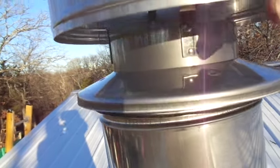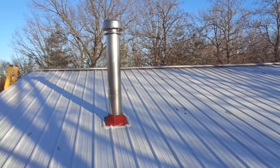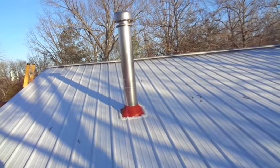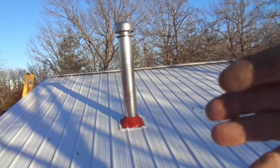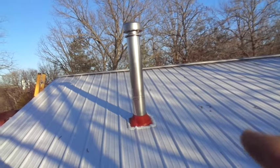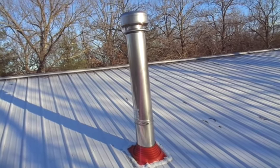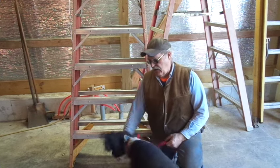These are the variations that vary from state to state, county to county, province to province if you're in Canada, that recommend different heights of chimneys. The rule of thumb in order to make a draw, in my experience, has said if you're within 10 feet of the peak of the roof, you have to extend your flue pipe above the height of that peak by a minimum distance. That has to do with gusts and drafts of the wind as it's blowing over top of your roof, having an effect on the down pressure — the negative or positive pressure possibly exerted on that flue pipe. If you're in excess of 10 foot, then you don't have to extend it above the height of the peak, but there's a minimum height that it has to be. I'm about 14 feet from the peak, so all I've got to do is just have a certain amount of pipe here. The taller the flue, the better it's going to draw. It was a little difficult holding that stuff in one hand, standing on top of the ladder, to get that in there.